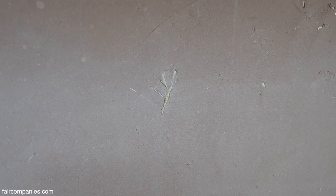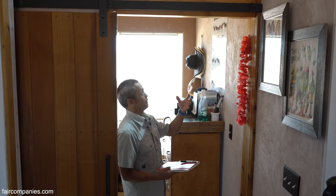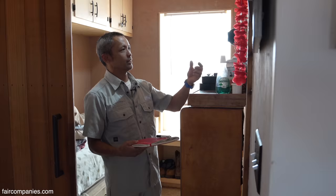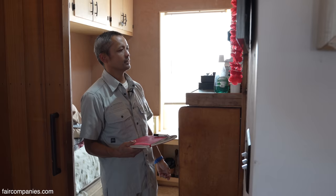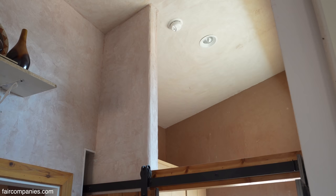Yes. It feels so nice in here too. Yes, the air feels good. And another reason we use the natural material is that it absorbs the moisture, so it controls the moisture inside. So that's part of the feel maybe in here. Yes, it also holds some dust, so this wall also creates cleaner air. And also we plaster thicker, which increases the fire rating, the time it holds even if it gets fire. It's quite amazing actually that a material can do that, that such a simple material has so many properties.